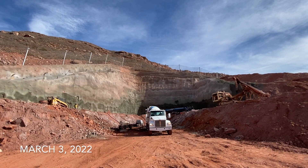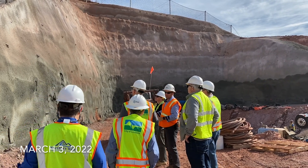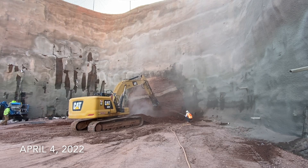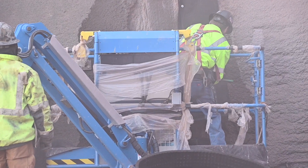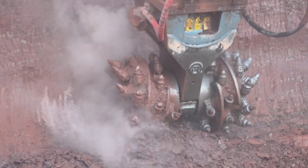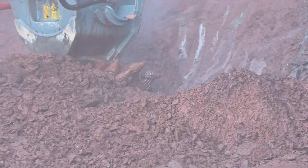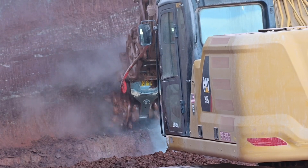Once that rock was blasted, we then proceeded with lifts, rock anchors, and shotcrete coverage on top of that as well. Today we're just starting downstream tunneling — we're only cutting three feet, then we're going to spray it with shotcrete for initial support. Tomorrow we'll come in and install our first steel sets and do another three feet. After we finish the first 20 feet, we'll transition to a regular tunneling operation where we'll be taking six feet per day.